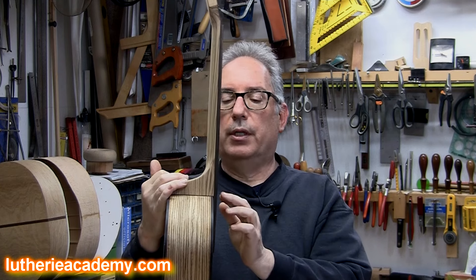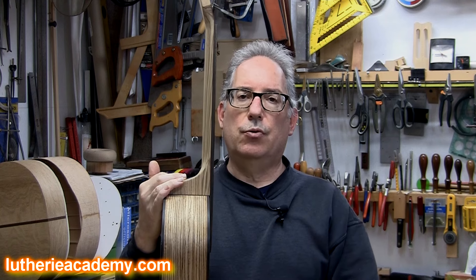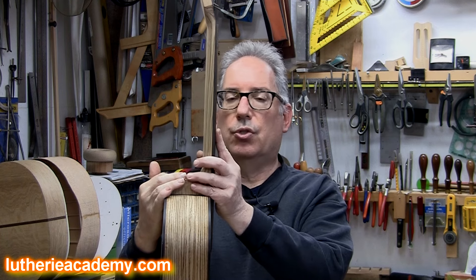That can be accomplished either by gluing the joint to prevent it from sliding apart, or possibly by using a pin. The pin prevents the two parts from sliding one relative to the other. A practical approach to using a pin is to use a wood screw. The wood screw can then be threaded in and out of the hole to remove the screw and allow you to disassemble the neck. That can be particularly helpful when it's time to do a neck reset — you do not need to steam the neck joint apart, you only need to remove the wood screw that holds the joint from sliding apart.